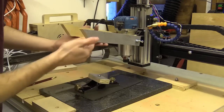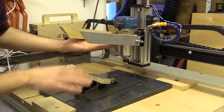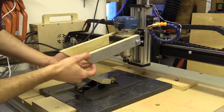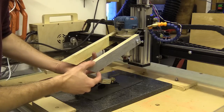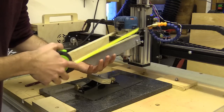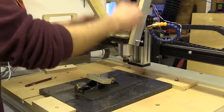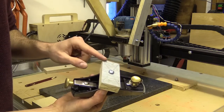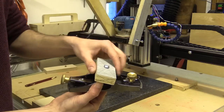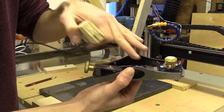I'm going to use my CNC machine to pull my block plane backwards and forwards on the lapping plate. I've cut two strips out of 18mm spruce ply which is 4cm wide and about 27cm long with a 45 degree bevel at the end. On the block plane I've cut another piece of spruce ply the same width as the spindle holder, with a hole in the centre which bolts onto the threaded hole that normally holds the blade flat.